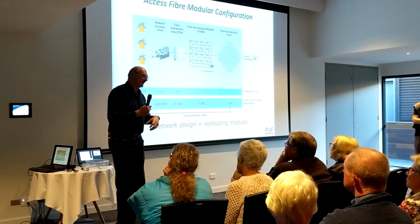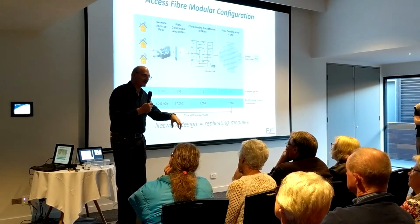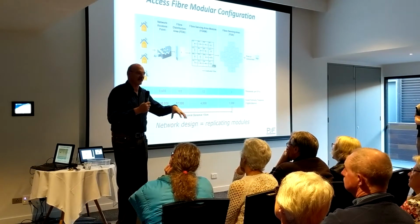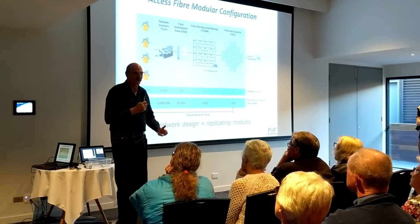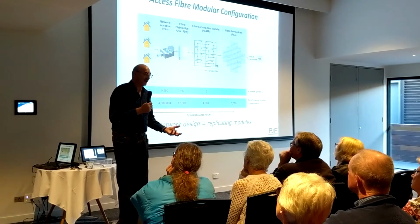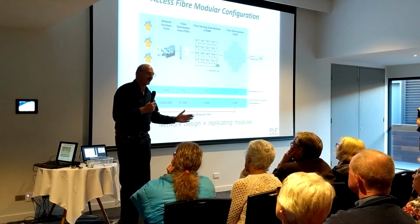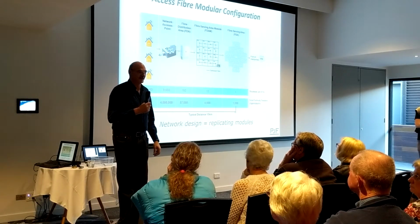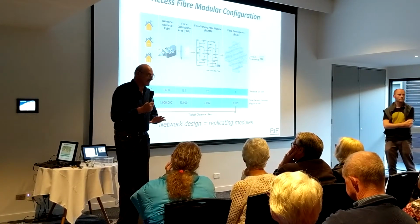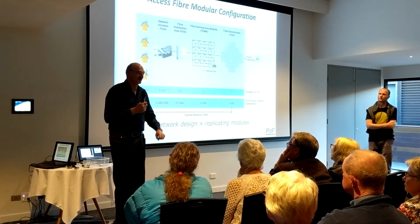So the issue with the fibre to the node is those active electronics in that box and the interference you get in the cables around that box and also the existing services from the exchange. And they all interfere with each other until 18 months after cutover, when everything's cut over, then it might get a bit faster. So that's the situation with the technology of fibre to the node.